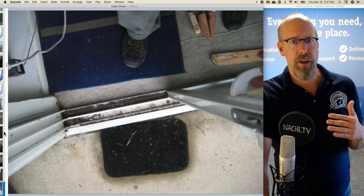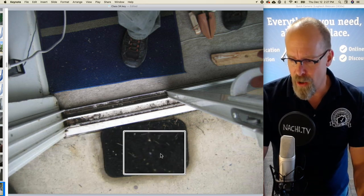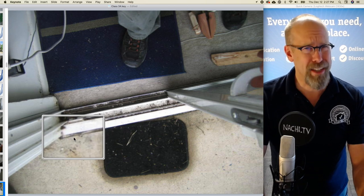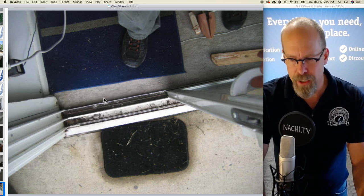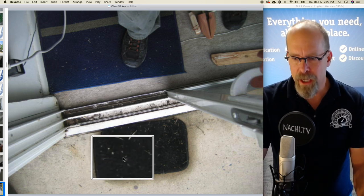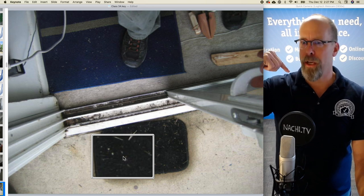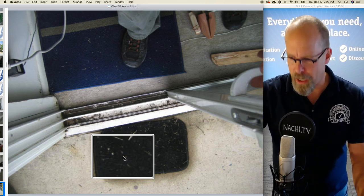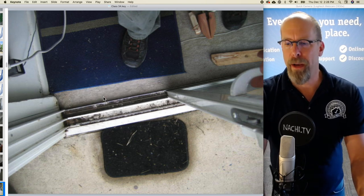The door's a concern. It's very close to the patio here. There isn't a whole lot of sealant. We saw the sealant problem on the outside. I'm not sure about water penetration. Sometimes they're splashing during a heavy rainstorm. And if the gutters are filled and spilling over, then water can splash at this area and splash inside the house. So I'm concerned about this area.